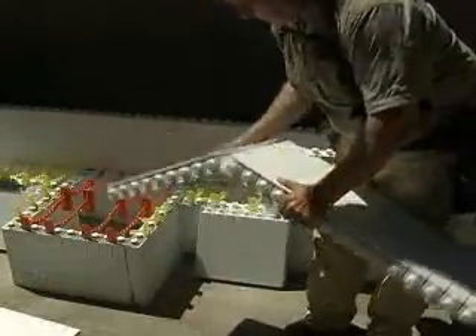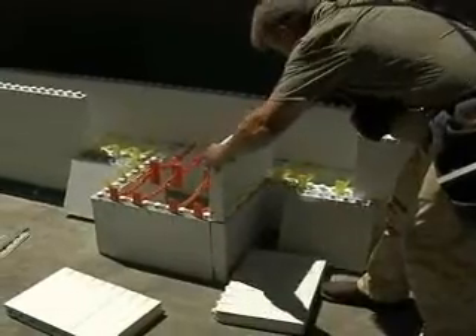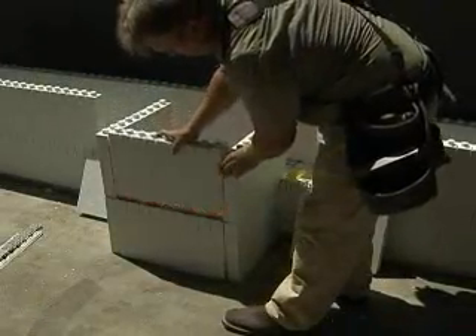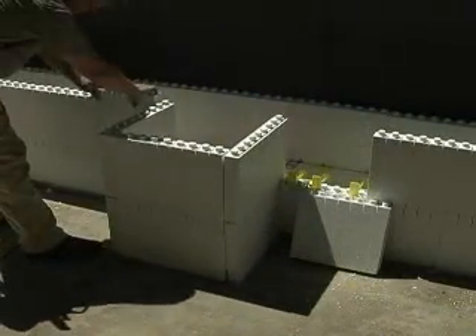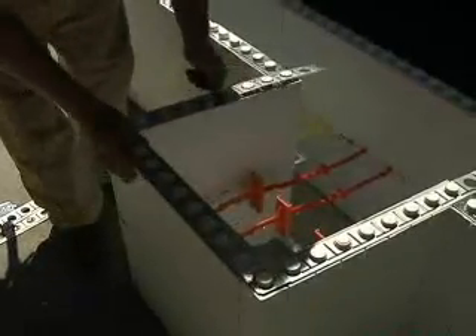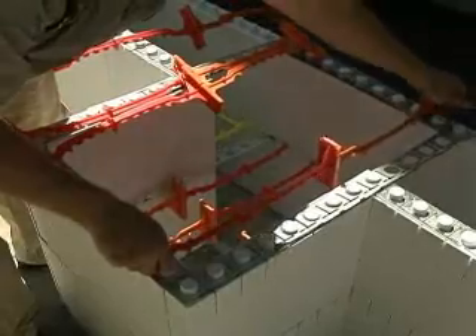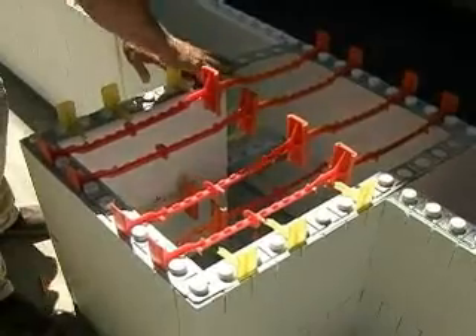Cut panels to form the column dimensions, making sure that the sides lap over the outside panels and lap inside the wall panels. Place inside and outside corner brackets so that the entire top dimension of the column is covered by metal brackets. Place combination ties across the dimension perpendicular to the wall, threading the individual tie through rebar. Insert flanges into every other slot on the outside panel, ensuring there are flanges as close to the corners as possible.